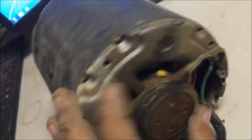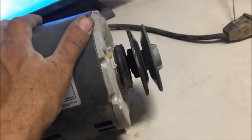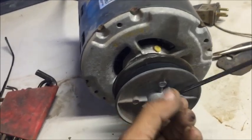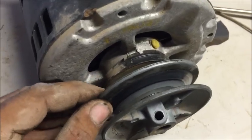We're going to adjust this pulley and lube it up a little bit. Right here — that's where you're going to put some oil on that bearing. Just pop that cap and drop a little bit of oil in the hole; it doesn't take much, just a couple of drops. Let's start by pulling this pulley off. We've got an allen wrench in the allen hole, and there's going to be one on the back side too.